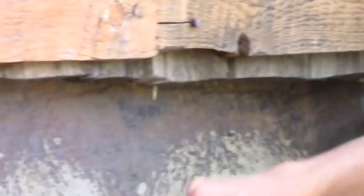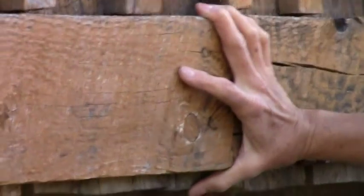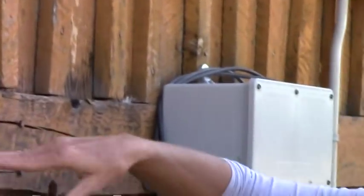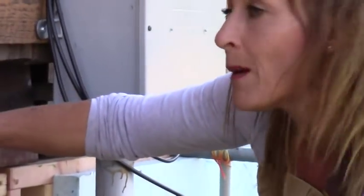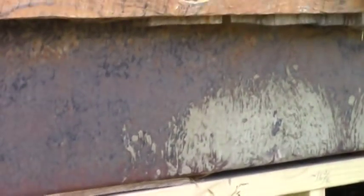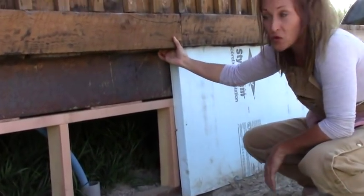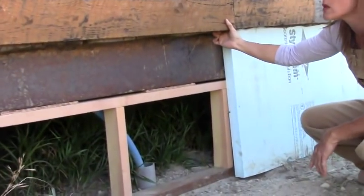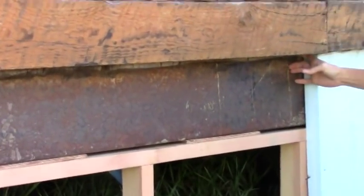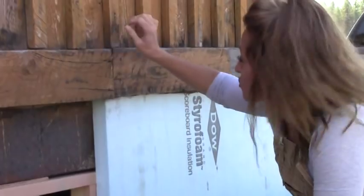What I think I'm going to do is pull out this trim and tuck a bunch of my metal underneath and behind it — I'll show you that down at the other end. This siding is very uneven; hopefully the trailer you have has straight and even siding to make things easier. Because of the metal beam on this side the framing goes underneath it, while on the other side without the beam it went all the way up to the 2x4 on the inside of the siding. The reason you want to tuck everything up behind the siding is so that rain and snow coming down can't get behind it.